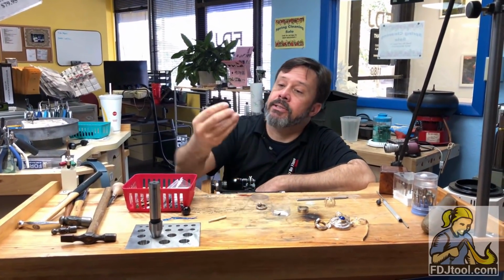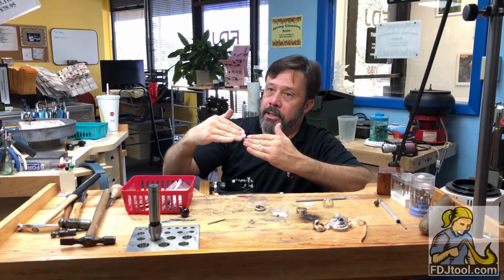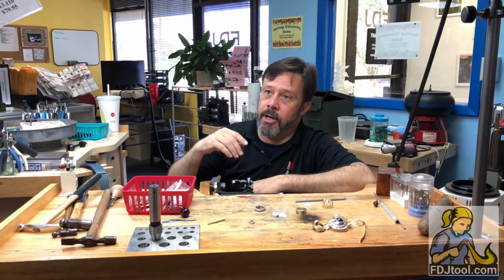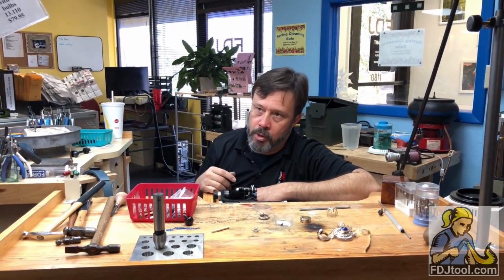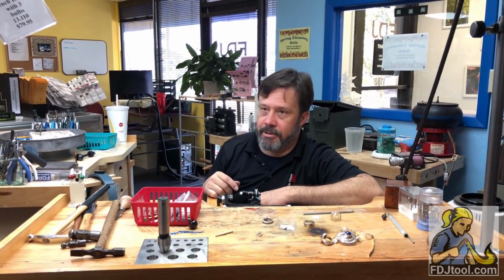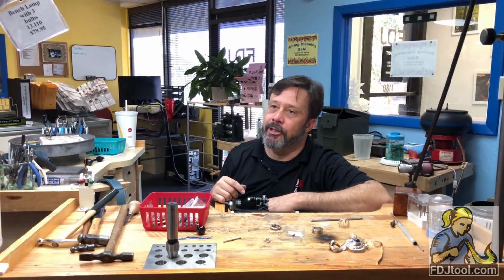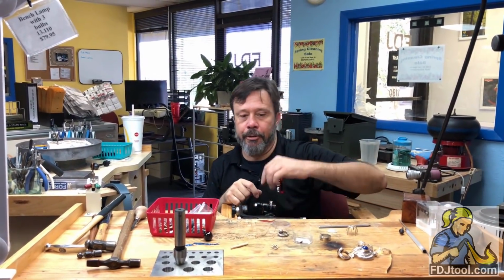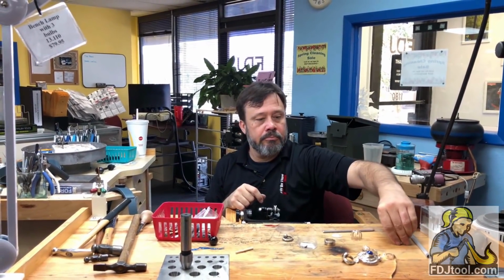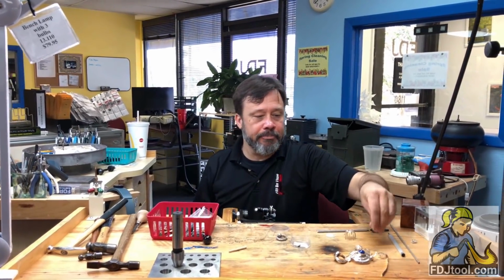I made this flat and then curled it around and then soldered it, then put it over a mandrel and hammered it into shape. Again, don't try to work with it in the round. It's a really surefire way to just ruin your day. So you made just like a strip. There you go. Form it over, solder it.